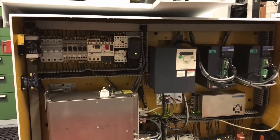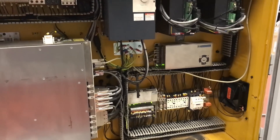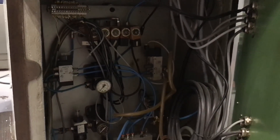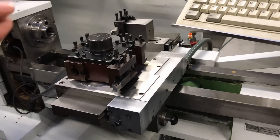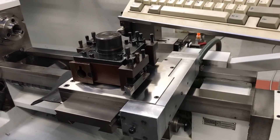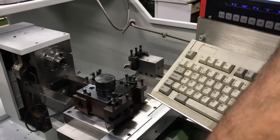Constantine has completely cleaned out and replaced everything in the control cabinet. Man, that's tidy. Do you still have the pneumatics in it? Kind of a mix — I've got some Festo in there. Are you still using the original switches? No, I replaced them with magnetic reed switches. I left the magnets there — they work well. Do you have any end stop switches, or just the same three? Just that — a cycle won't go very far.